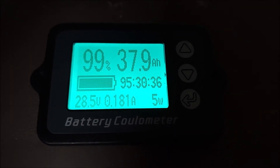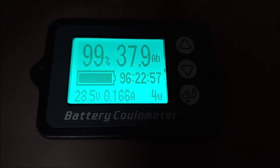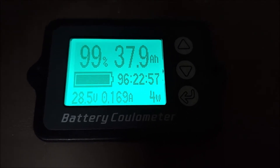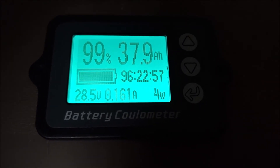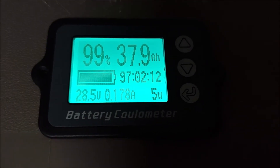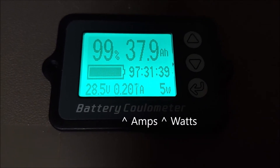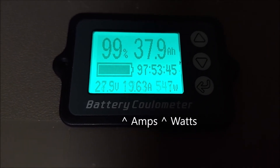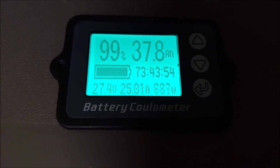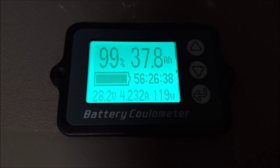So here's the battery meter — you can get a better view of it here. You can see it says the battery is 99% full, 38 amp-hour, 24-volt battery, 96 hours of standby power. Right now we're drawing about 100 to 200 milliamps. I'm about to fire up the bench grinder — watch the bottom right-hand corner. That'll hit almost 1,000 watts of draw. There we go — 31 amps and nearly 900 watts of draw, and the inverter took it without a problem.